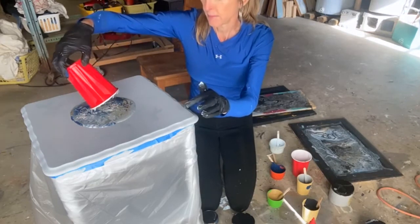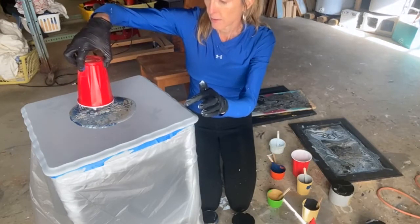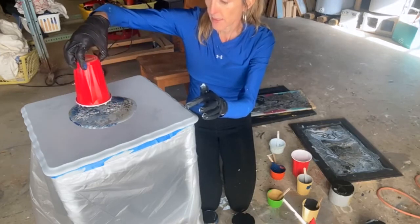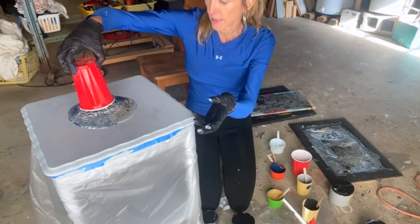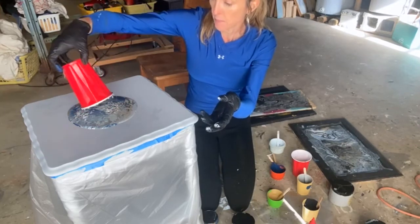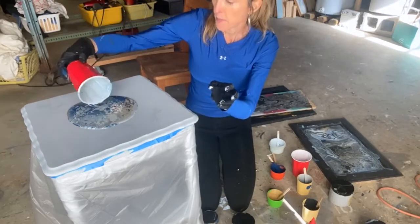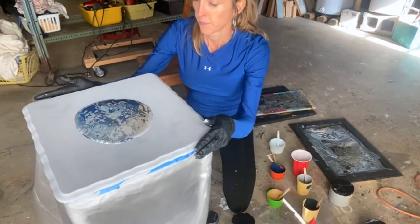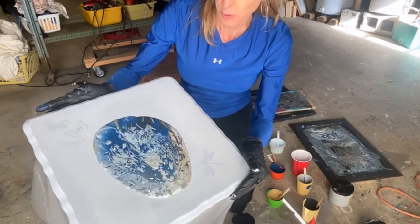This is a piece I did last year and I painted it originally in drop cloth. Throughout the course of the last nine months, I've seen a reddish tinge come through. I had primed it, but apparently I didn't put enough primer on it. This time, all that's on it right now is Dixie Belle's Gray Boss, and I put two coats on to try to prevent bleed through.